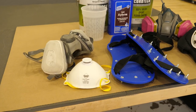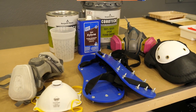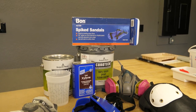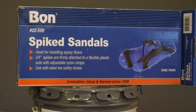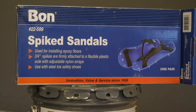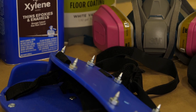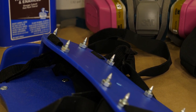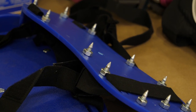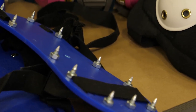Some kind of roller — I like these little rollers for cutting in. A phenolic roller is preferred. Spike shoes are probably the number one game changer if you've ever laid a large surface area of epoxy flooring without them. You need long poles for your rollers. I purchased these on Amazon for about $17 or $18, and they're invaluable. They're designed for concrete flooring, so if you have a wooden subfloor like me, you'll want to file down the tips to a ballpoint so you don't pierce your perfectly prepared subfloor live in front of 100 people.